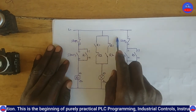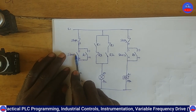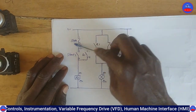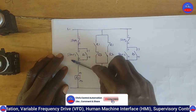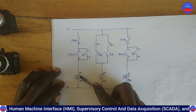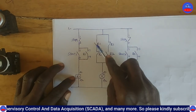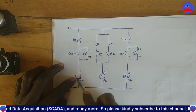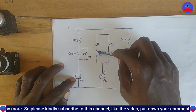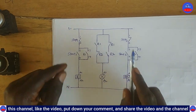We are going to turn on the bulb by pressing Start Button 1. As we press Start Button 1, current flows through the closed Stop Button 1 contact - since the start button is now closed - current flows through Relay R1 to energize it. The moment R1 energizes, the hold-on contact changes state. As this contact closes, current flows through this closed contact and through the closed contact on R2, and the bulb comes on.